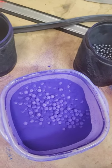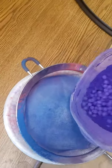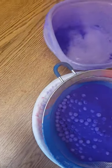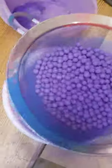All right, well they're purple. I got a little screen here — I got it at Walmart in the spaghetti aisle section. I dump them in there, powder and all. You just pick it up and start shaking it. You can see the extra powder coat going away. You watch the bottom and when you don't see any more falling, it's done. I got a little toaster oven heating up right now to 400 degrees.